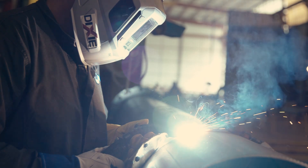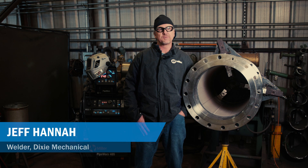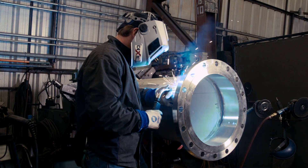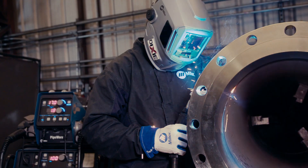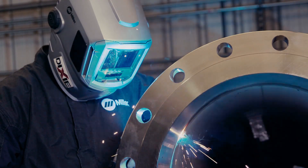By running the RMD on stainless, you eliminate the back purge, so you're not having to tape up the ends of the pipe or put caps on it and put a purge hose in there to get all the air out of it. It takes time and extra gas to purge a piece of pipe to get a good quality TIG weld in it. With the RMD you don't have to do all that — you can just set the pipe up, run the RMD, and have a good root pass, then continue on with the cap.